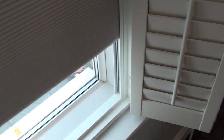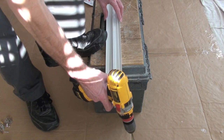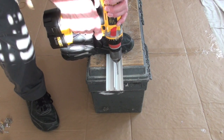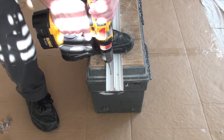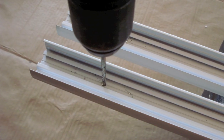I'm going to show you how to fit a blackout blind into a medium shutter frame that's already been fitted. You need to drill some pilot holes in the side channel. How many will depend on the height of the window — normally one at the top, middle and bottom. I'm using a 4mm metal drill bit. There's a small groove in the centre of the side channel; this is where you need to drill your holes.